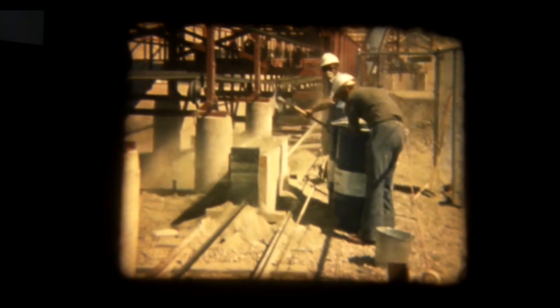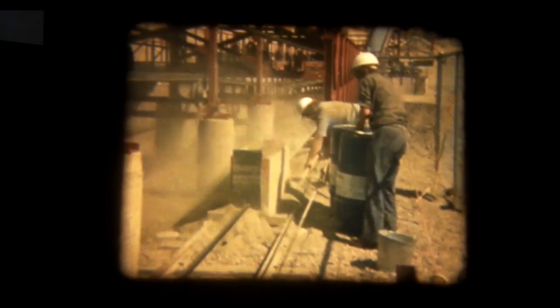You can see that we have a box rigged around the rope as it runs through the tension area. Into this box we are shoveling cement dust. With the conveyor running, the rope passing through the box gathers the dust, which, it was hoped, would soak up the grease and dry the rope.